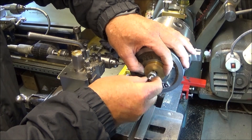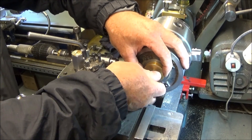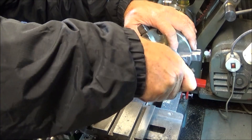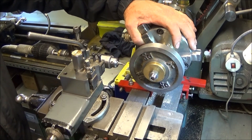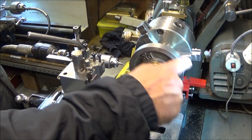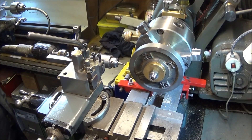The disc will go on the front and lock the weight onto the brass bar, so I'm using it as a temporary mandrel. Eventually I'm going to use the brass bar as the finished component that will hold the weight and the chuck together. Using this method I've finished turned to the diameter and now I'm going to do the 24 evenly spaced holes around the diameter.